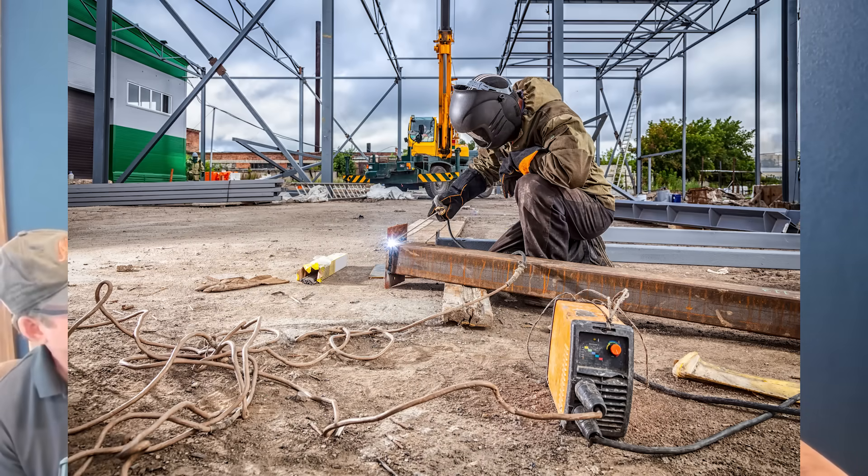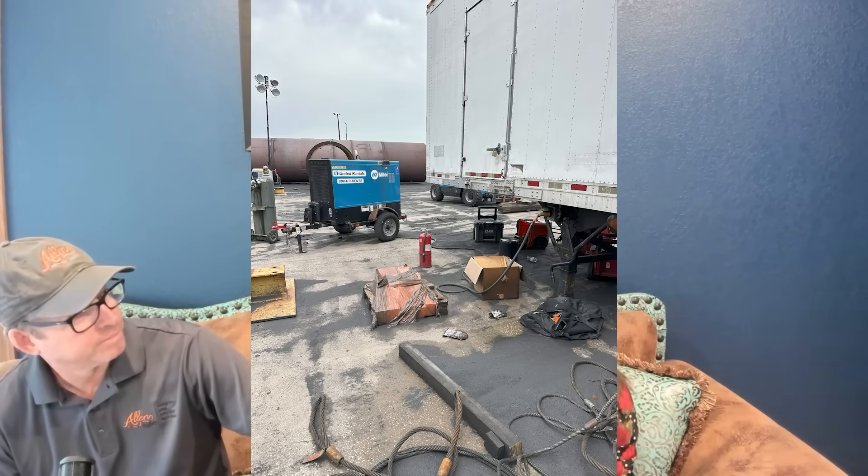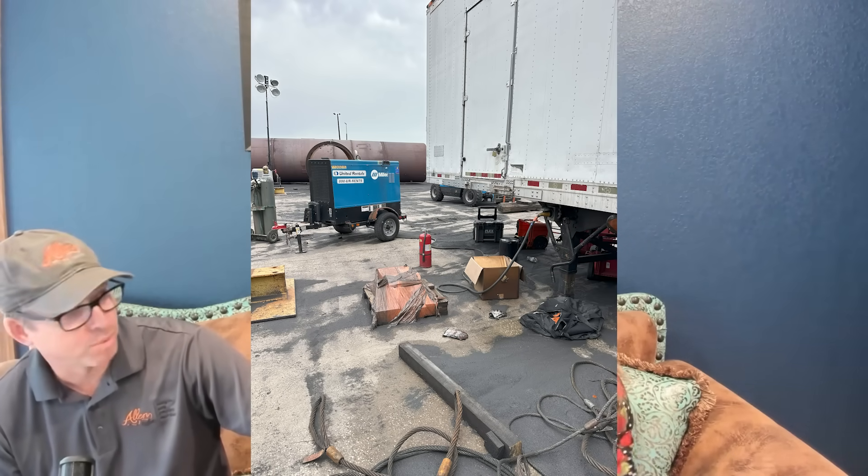So the permit — for example, the 35-foot clearance. We're going to clear out everything in 35 feet. That's when you start. I had a 24-hour hot work project this week. Guess what? Things are shuffling around all day long. Someone's going to move a trash can over there before they go to break. Someone's going to move a flannel order and put it down — some weird combo gets brought in. But it was clear at 35 feet when it started.